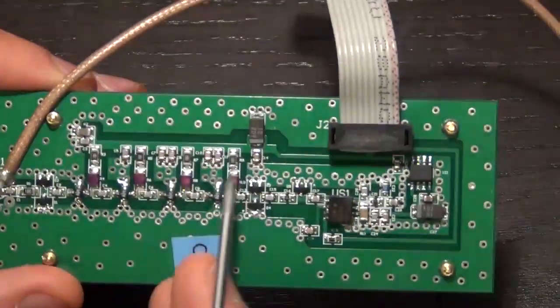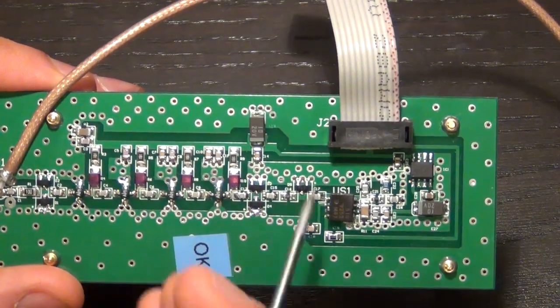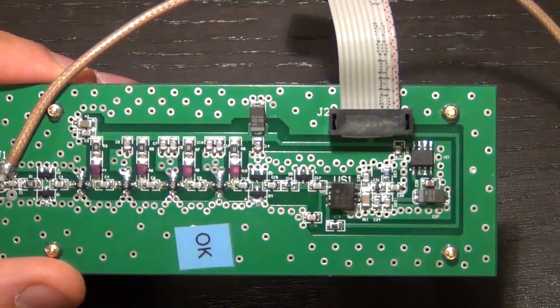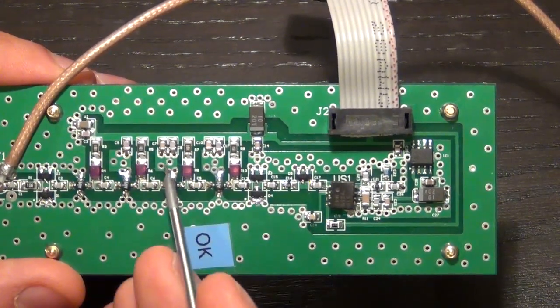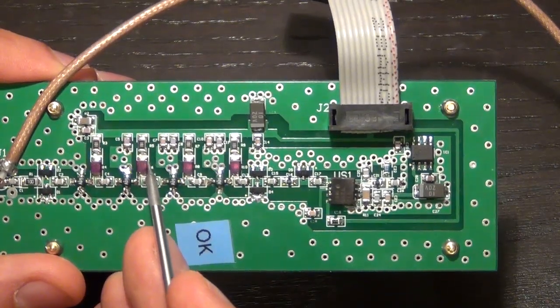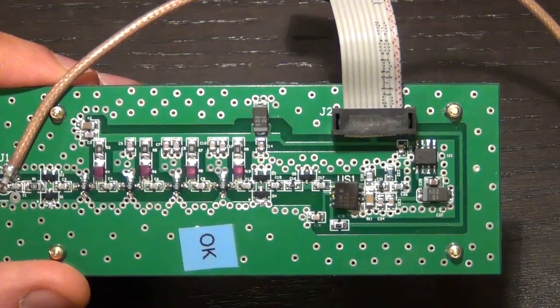And if you don't do that and the impedance of this line changes, it can look inductive and capacitive depending on the length and the frequency, and that can cause not just oscillations, but it can cause notches in your frequency response, where your amplifier, for example, all of a sudden would have absolutely no gain at 1 gigahertz because it lands in a notch where the VDD is an open circuit, which would be terrible.